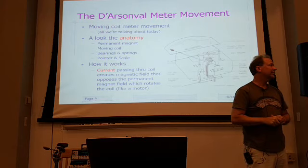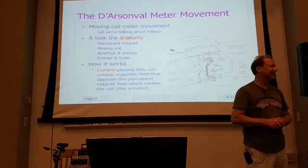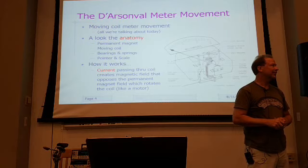Yeah. And the problem is, in one case, I had a dual power operation. The RF thermocouple meter's normal current at one power was 3.29 amps. We had a 4.5 amp meter. But when I dropped to a different power, it went to 1 amp. I had to get a different meter. We had to put shunt switches across them and switch the meters in and out.